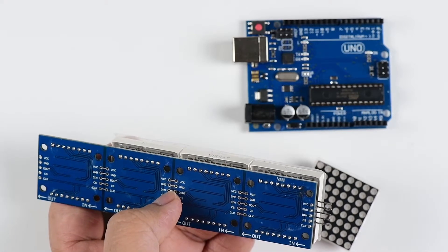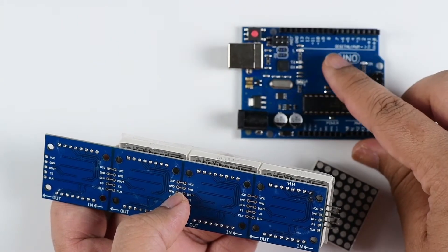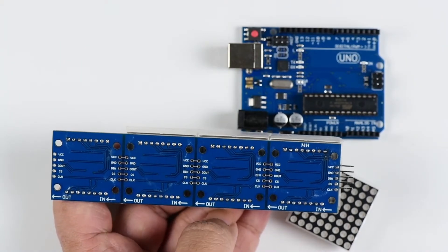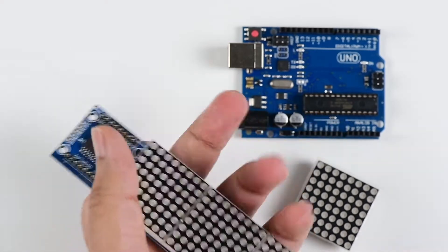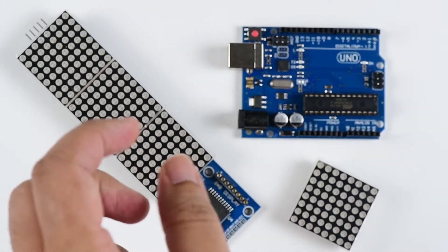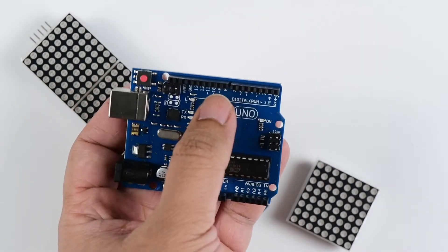For the remaining three pins, you can use the digital pins — from seven, eight, nine, or any of the digital pins. The standard libraries use pins eight, nine, ten, or seven, six, five depending on which sketch you're using. That's one thing you need to keep in mind: the power consumption. You can't have the entire display powered by just one Arduino board, because that will completely wreck it.